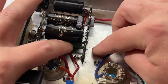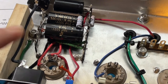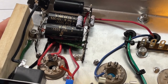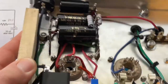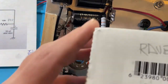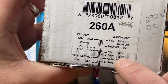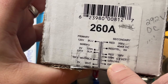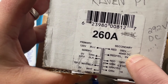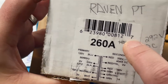I zoomed in a bit — I don't have the heater wires soldered in yet, but I want to show you what I'm doing. There's going to be a difference in the way you wire the heaters using one of these police radio transformers versus the Hammond transformer. Usually those wires are green for the heater — the heaters are the filaments in the tubes, the things that get hot. I've got this lead coming out of the transformer: 6.3 volts, one amp of power — that's the green one. There's also a green-yellow wire which is the center tap, just like we had a red-yellow wire at zero volts center tap on the high voltage red wires.